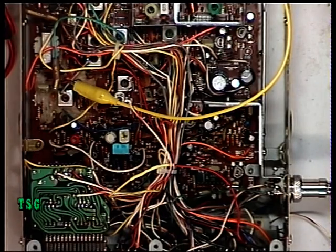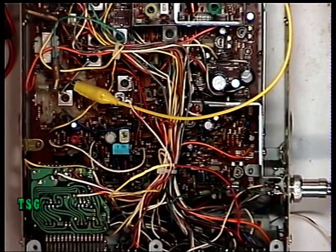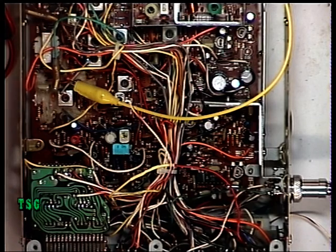The Rotel RVC240 — the front of which would look like that if it was on the set. This is the receive side. The service manual says, on receive, connect your test meter between test point 2 and ground and adjust transformers T5, T7, T8, T9, T10, and T11.